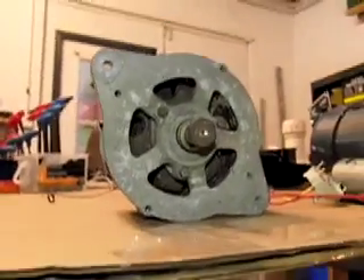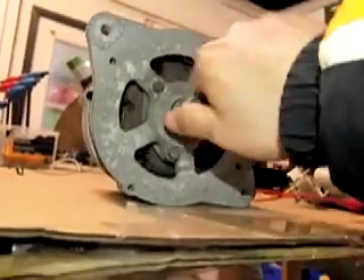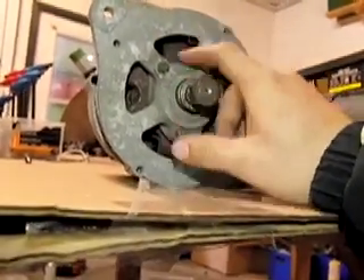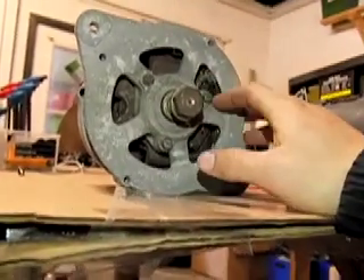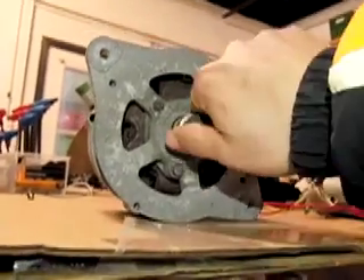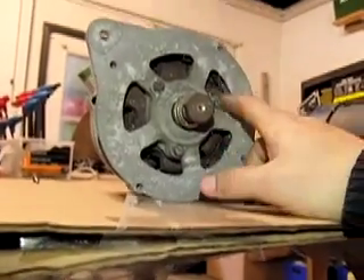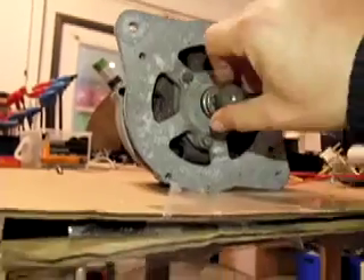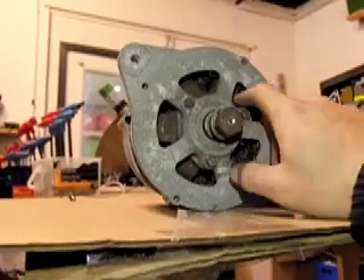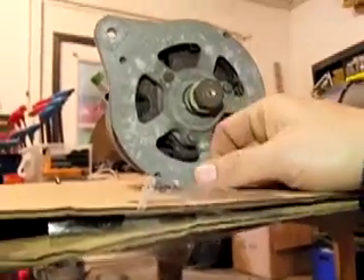You're constantly driving, your engine's running at 2,000 to 3,000 RPMs. This is actually usually pulleyed down — they run on a smaller pulley so these can spin a lot more RPMs than your engine. If this were to just run and be a generator the whole time, you would overcharge your batteries and put a constant drain on your engine. So whenever your car or truck doesn't need it, the magnetic field in there drops and this basically spins free. That's why hydrogen generators are really questionable in my opinion — you're putting a load on this causing additional drag on your engine, so whatever they produce is pretty much created from here and lost.